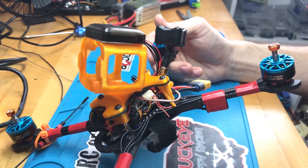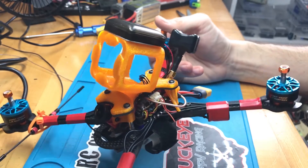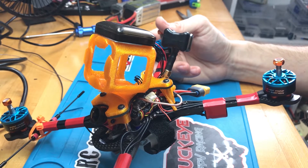Other than that, I'm going to be running a combination of 4S, 5S, and 6S batteries on this. I've bought some 1800 or 1500mAh and 2200mAh 5S packs, and then a bunch of 4S batteries ranging from 1300 to 2200mAh. I'll be testing that out and seeing what gives me the best performance and longest flight times, and I'll make a video reporting back on that.